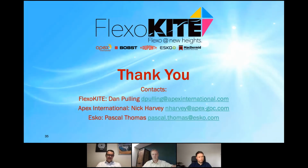So this is, as Rob said, to measure print film weight in a 10 centimeter square, and then measure a printed sample, that's fraught with danger of being accurate, because your film thickness can vary 1 or 2 microns from the one that you're taking as the blank to the one that's got ink on. And there are ways where you clean off the white and then do it again, but it's not a perfect solution. What we've got is actual longevity of a print run, and their physical weight, which was very, very controlled in its manner, and there are the results.